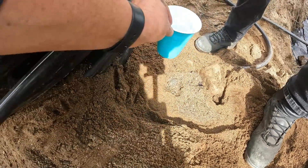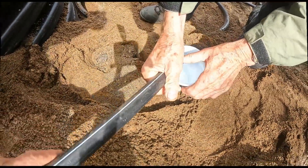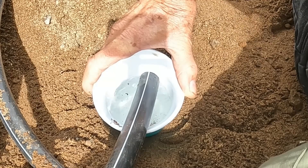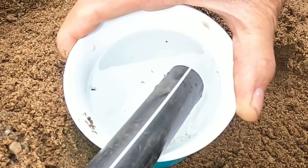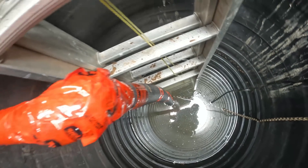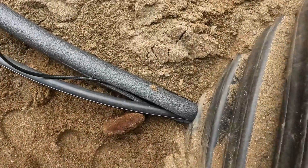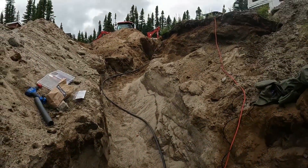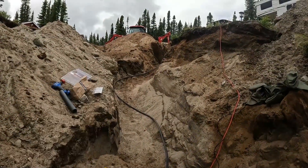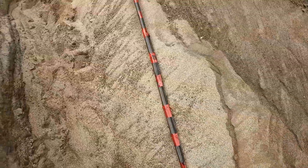So my father's going to hold this glass right under the pipe there, nice and low, and then I'm going to put the water in the top. Here we go. The same amount of water came out as I put in, so that means there are no low spots. As you can see, I insulated the pipe from the pump up and now I've got an elbow which is insulated as well, gone out through the side of the well. That comes out through here and it's going up and under the ground about two to three feet. Of course we're going to heat trace this the whole way and put the insulation on as well. There we go - all heat traced now, I'm going to put the insulation around.